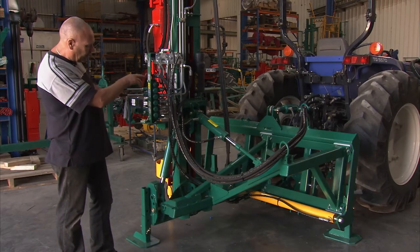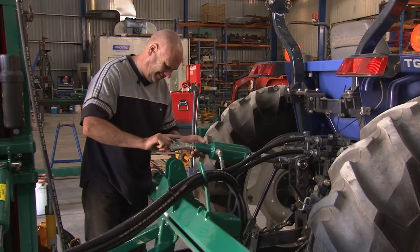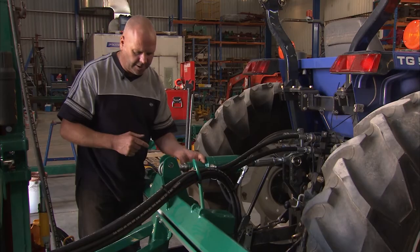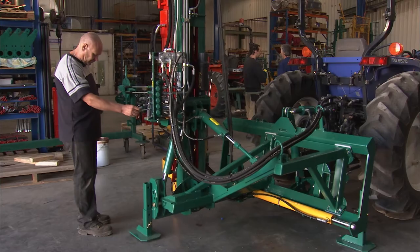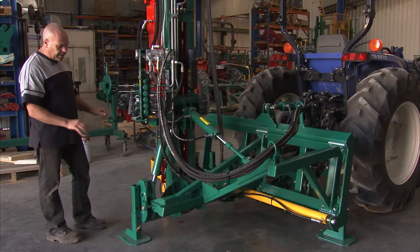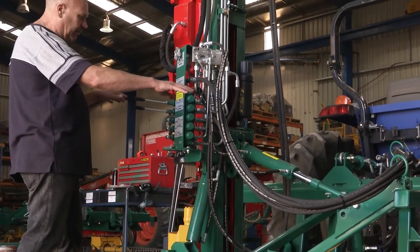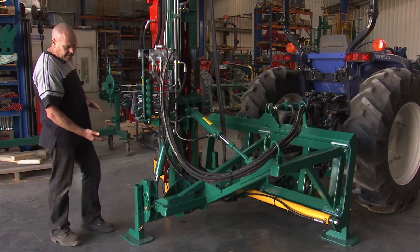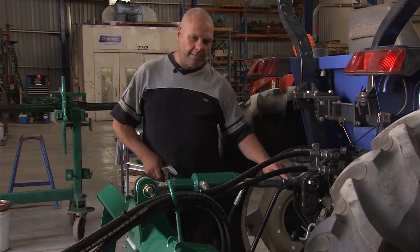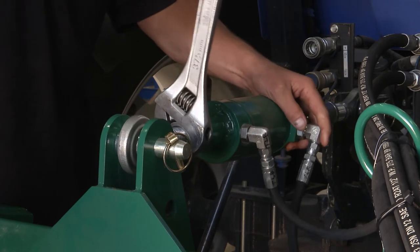When we drop the machine back on the ground, we can take the load off the top link, which allows us to pull the pin out and make the adjustment on the rod end. To line the hole up again, we need to retract the cylinder — we can use the side shift function to do that. That adjustment's pretty good where we've got it now. If we make it too long, when we use the hammer function to push this foot into the ground it would lift the side shift feet off the ground and make them unstable. So you've got to find the happy medium where the foot's lifting off the ground the right amount. Once you're happy with that adjustment, tighten the lock nuts off and make sure the cylinder can still move freely.